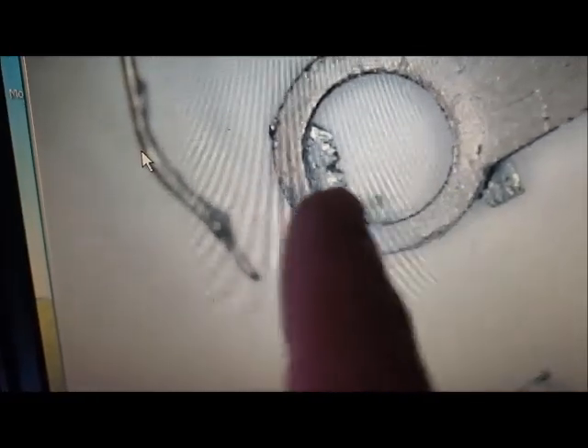You can clearly see the germanium crystal, but there is some black in it — that's why I was thinking maybe this exhibited thermal runaway. When I take it apart, this piece was already separate, and these two pieces were connected together but there was black on one side. That's why I figured this transistor failed due to thermal runaway — it just kept heating up until it overheated and blew.